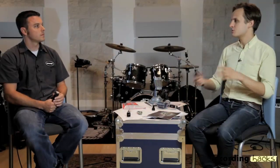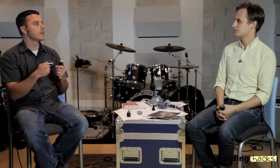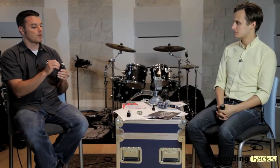So how does what we're doing to tune the polar response affect the frequency response? That is to say, if we took away all of the porting and made the 57, same capsule, an omnidirectional microphone, how is what we're doing affecting the tuning of the frequency response as well? Vastly. They're interrelated. That's one of the difficult parts of designing and tuning and making a dynamic microphone: every single aspect of this dynamic microphone has an effect on something else. So you can't tune the microphone's response and then go tune the polar pattern and then go tune this. They're all interrelated. You change something here, you're going to probably screw up something over there.